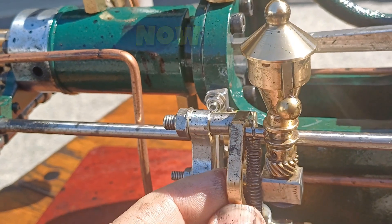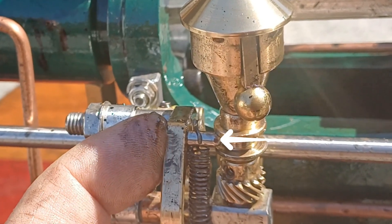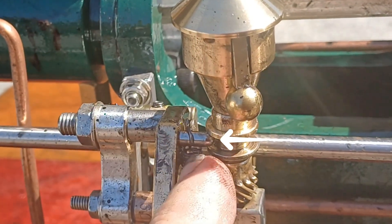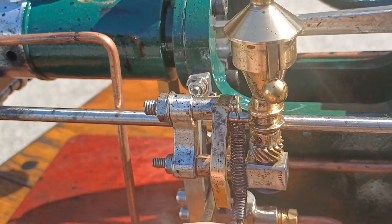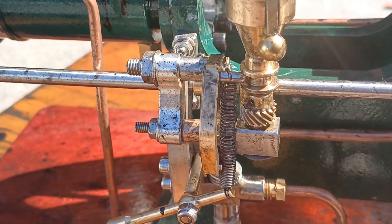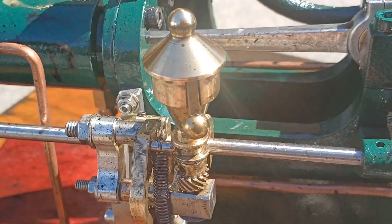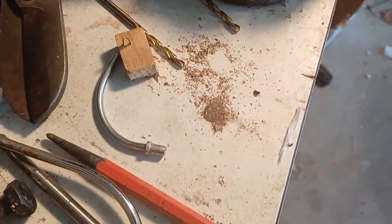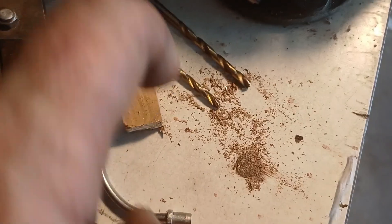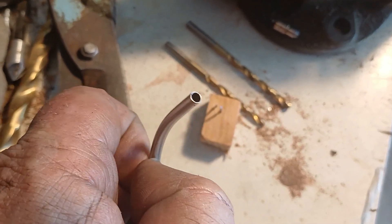The right spring fixed that, but here I think this pin is too close to where that angle goes, and that's why we need such a strong spring. Also the spring rubbing here is messing things up. So I'm going to work on improving the pin on the governor on the diesel engine. I've got a 3.5mm and a 5mm — one is internal and the other external — and this is going to go over the pin on the governor.